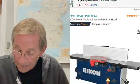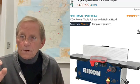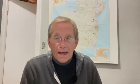The last one I looked at sells for about $450 to $550 — the Rikon. It had the smallest diameter cutter head at two inches. Because of that smaller diameter, the cutter head speed is 12,000 RPM. The point being there seems to be a broad range of cutter head speeds across jointers, and all of them seem to work fine. Nobody reported burning or scorching — in fact, quite the opposite.